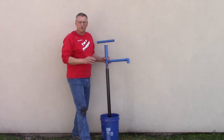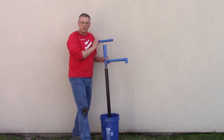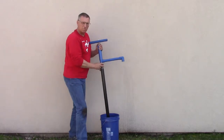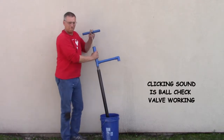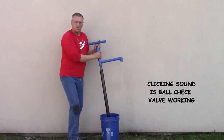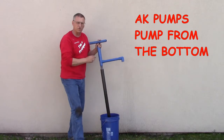At this time the pump is functional. To better visualize how the system works, we invite you to test your pump now. Loosely spin on the T-handle to the threaded rod at the top of the well head, then dry fit the spigot into the T-fitting. Place the bottom of the pump into a five gallon bucket of water and tilt it slightly. This system does not suck water from the top — it pumps from the bottom. It's a much superior system.